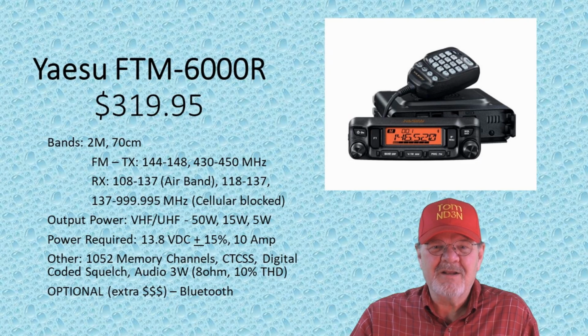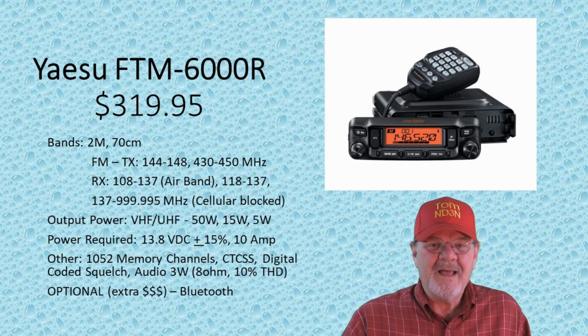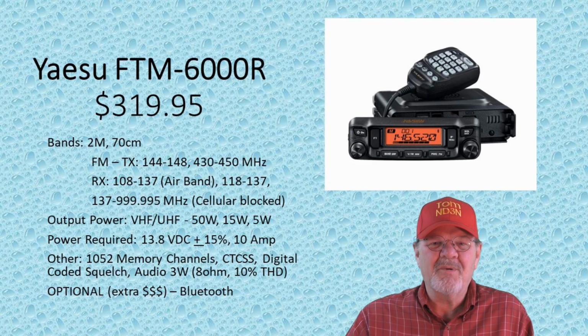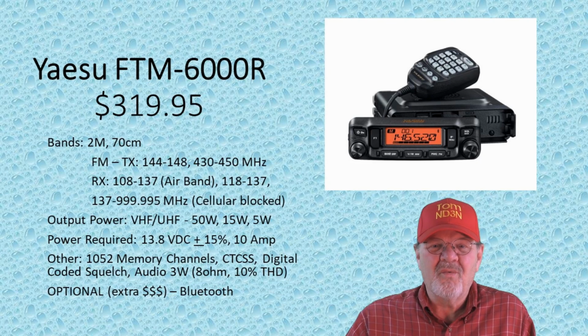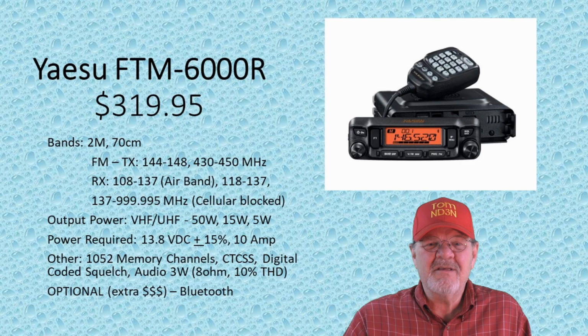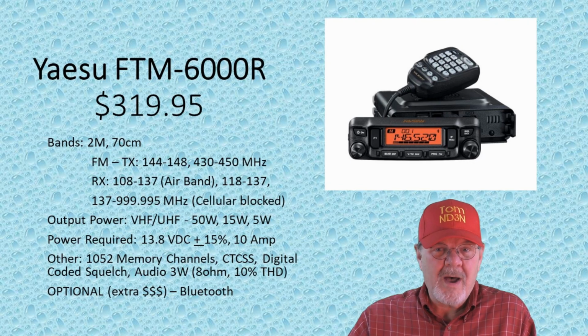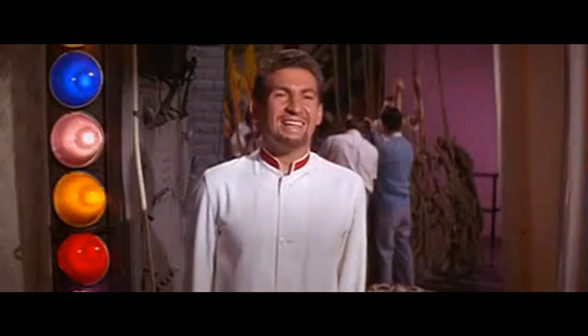Output power is selectable on both bands at 50, 15, and 5 watts. The rig will pull 10 amps when using full 50 watt output. Now this rig has 1052 memory channels and an output audio of 3 watts into 8 ohms. Bluetooth is also optional in this rig.